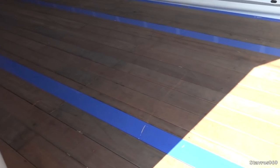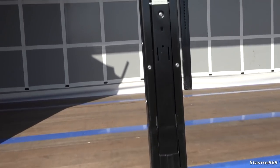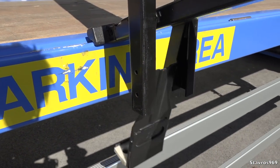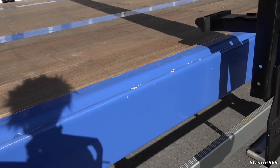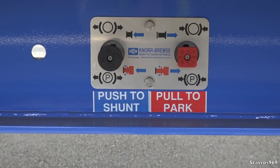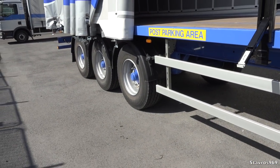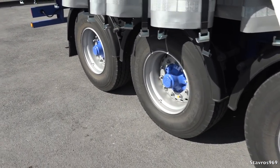You really need to get the straps out of the way when forklifts are loading your trailer, because forklift drivers will just roll over your straps and bend or damage them. It would have been nice to have a hook or some way of tying the strap in to keep them out of the way while the truck is being loaded. There is your post parking area, and these poles are very easy to open and slide anywhere you want — you can close them anywhere on the trailer. We also have the shunt button, the parking brake, the specification plate, and it is a tri-axle trailer. Both the front and rear axles are permanently down; neither lifts.